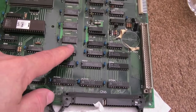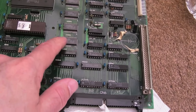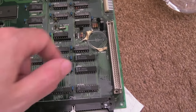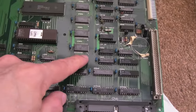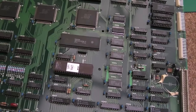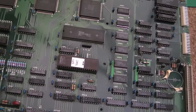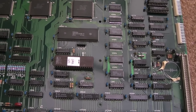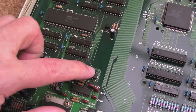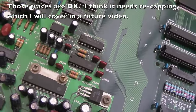The backup RAM - it was giving a backup RAM error before, and then I removed the battery and it was alright. So there's a chance that chip might need replacing, or it could just be bad connectivity. There's certainly no corrosion around here at all. I'm nearly done now, I'm not going to get this perfect - I just want to get most of the dirt off so it's clean to handle and you don't get black hands every time you touch the board. The audio side might need recapping. I think I'm going to inspect that trace next to see if there's any damage - maybe that's why there's no sound coming out of this.